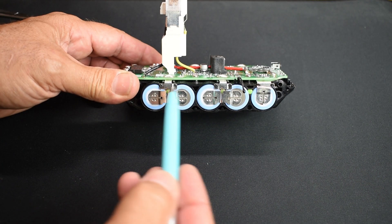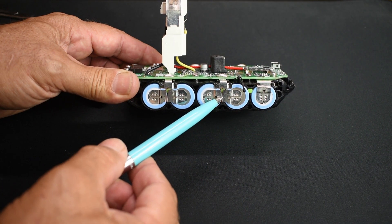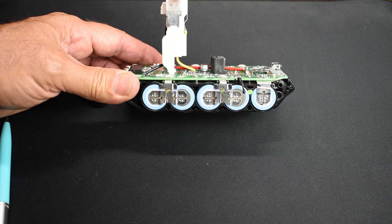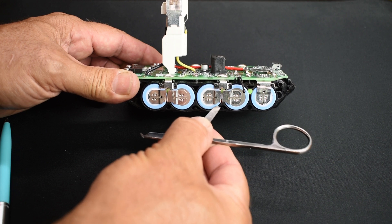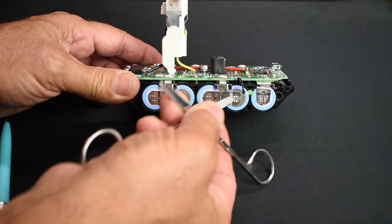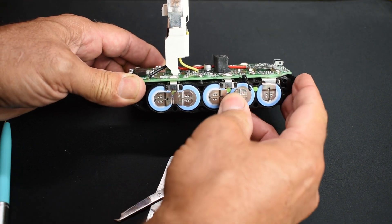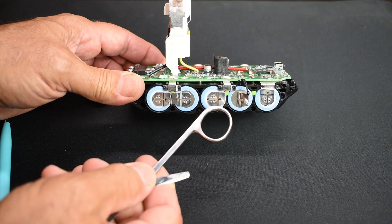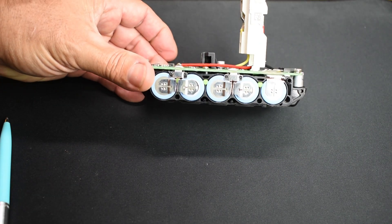Here you can see clean cuts — clean cut, clean cut, clean cut, down the center as well. Now very carefully reach under the tab and fold it in this direction. Make sure you do not gouge the outside jacket because you can create a short between the positive and the negative, which is the jacket. Just reach in, use a hook, and pull. Now I can bend it in so the cell will be able to pass through the tube easily and out the other side.